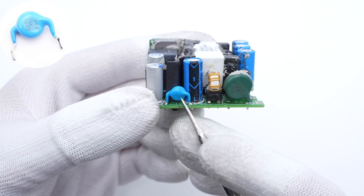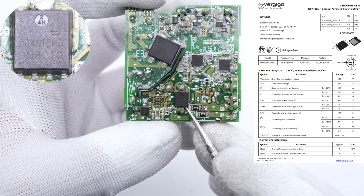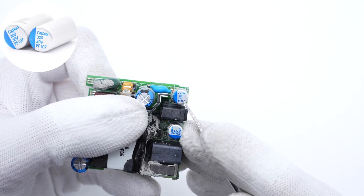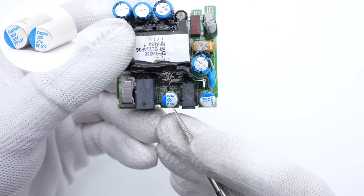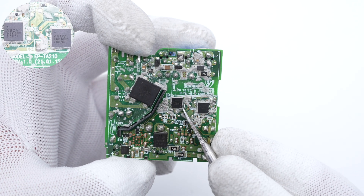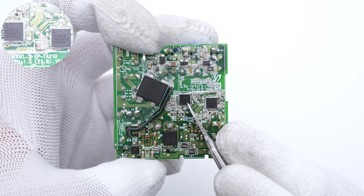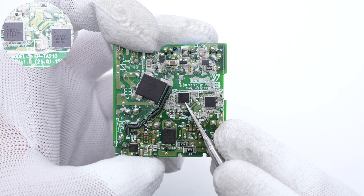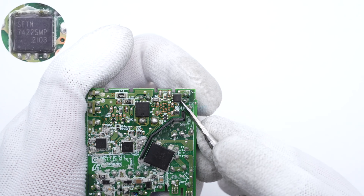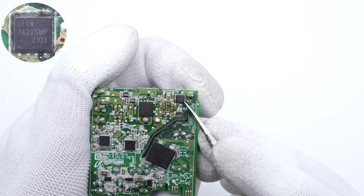The synchronous rectifier is from Vergega Semi and adopts a PDFN5060X package, rated 100V, 3.8mΩ. Those two solid capacitors are connected in parallel for output filtering — they are from Capxon PEF series, 300μF, 30V each. The two protocol chips are from ABOV and are used to control the USB-C and USB-A ports respectively. They integrate an 8051-core with 16KB flash, and the withstand voltage is 30V. The VBUS MOSFET of the USB-C port is from Winning Semi and adopts a DFN3030 package, rated 30V, 4mΩ.